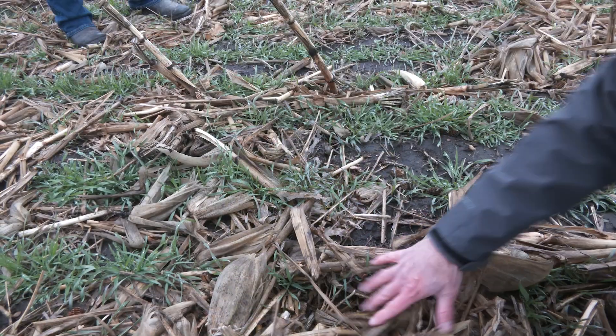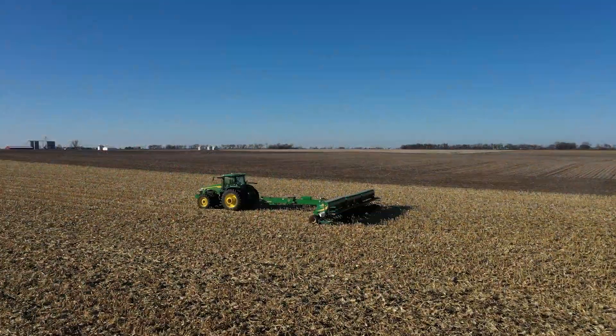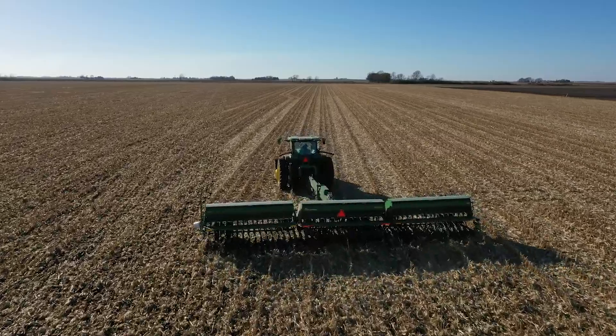One of the key takeaways for Great Plains here is seeing that in this heavy residue no-till environment, our BD 7600 drill was able to adequately handle that residue and get good seed-to-soil contact and achieve an acceptable cover crop stand. This drill was set up on 10-inch spacing. Specifically with this drill, we chose to go at a 10-degree angle and it definitely helped going through that residue a lot easier — we didn't struggle at all. Going on an angle of the rows is important, and that 10-inch row spacing is also key to allow a little more space between those opener blades for the residue to flow through.